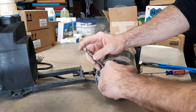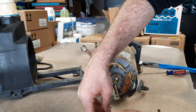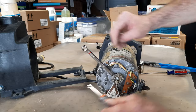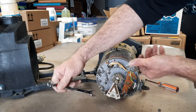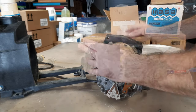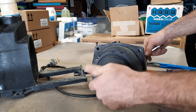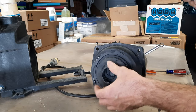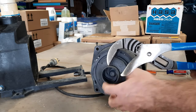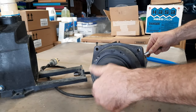If you can't access the shaft back here and get the wrench on, the quarter inch driver will fit on here and you can just pull this piece off, and then you can access the 7/16 wrench anywhere around the whole thing. On this particular Hayward motor, it's built to get in there. Once that's locked, we can usually just turn these off. If the impeller was locked on there and I couldn't get it off, I could use a pair of channel locks — I like to put some duct tape on here so I don't damage the impeller. But it was free, so now we can just spin this off.